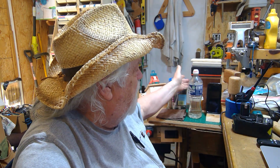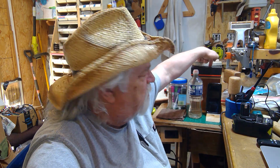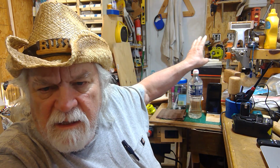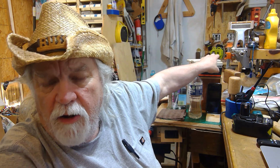I'm still doing little things around here. I really want to put together, if you're interested, I don't know if you're even interested or not, but I got a box back here, a leather hinge, some relays and switches in here, and I'm going to make an off-grid light that plugs into the wall outlet. And when the switch is on, there's no power. The light doesn't come on. But if the power goes off, and all of a sudden the plug-in doesn't have power to it, then the light will turn on automatically. So that if I lose power in the house, this light will turn on.